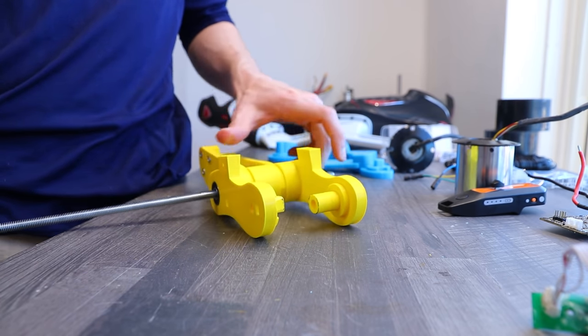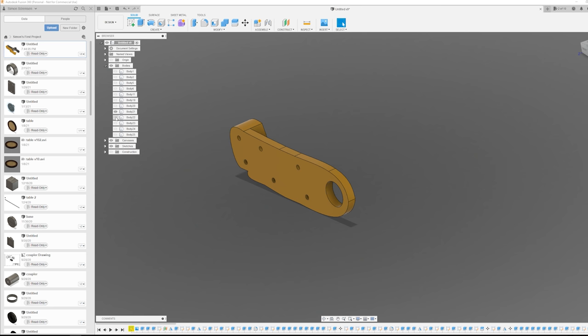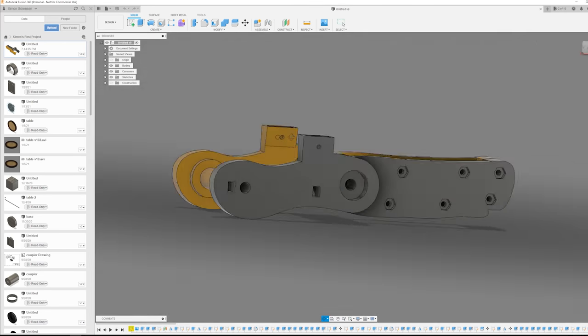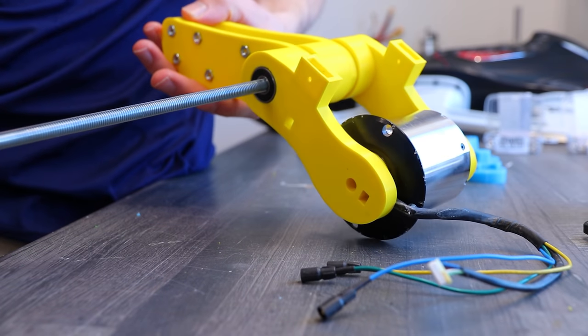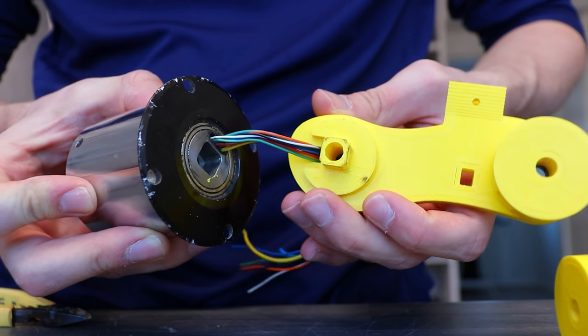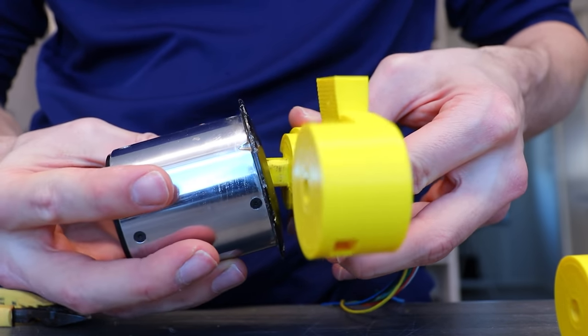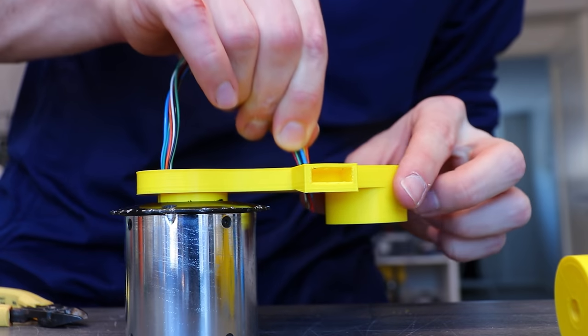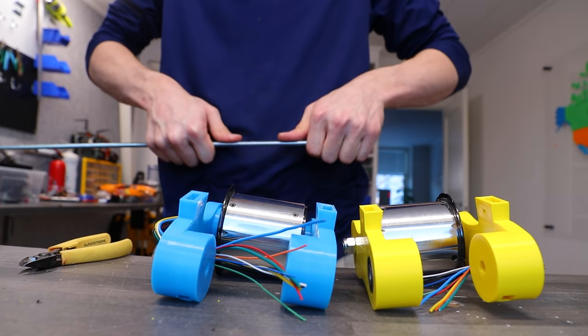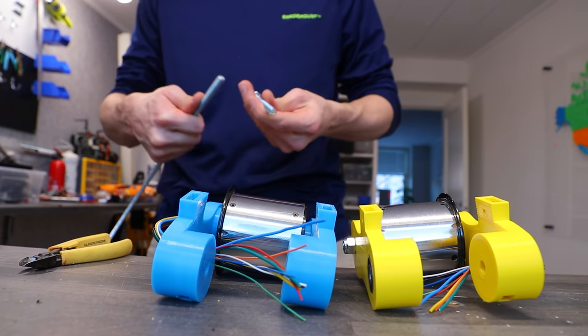The 3D printed structure will be the skate attachments and the spacer. The two parts that hold the motor can pivot so that the springs can keep pressure on the wheel, always keeping the wheel engaged with the ice. You see the little plastic square? That's what keeps the entire motor in place. I also routed the wires in such a way they wouldn't snag, and I cracked the rod in half, because my editing — I mean my strength — is just that good.